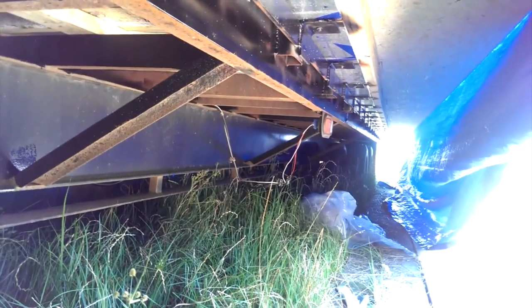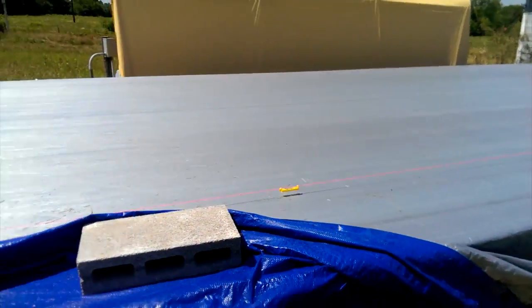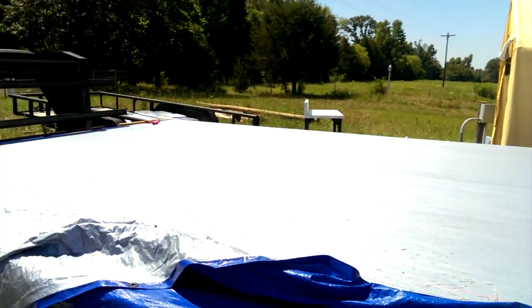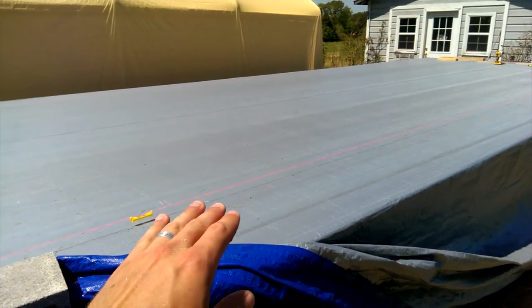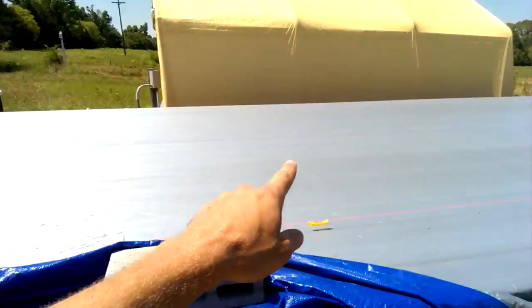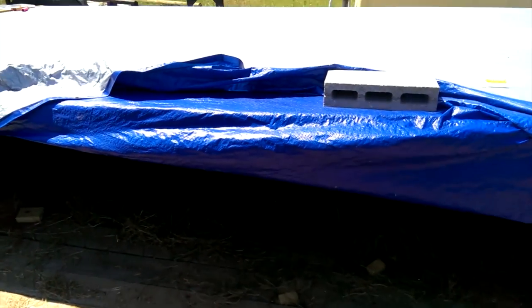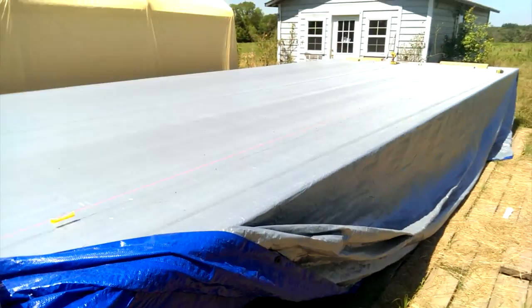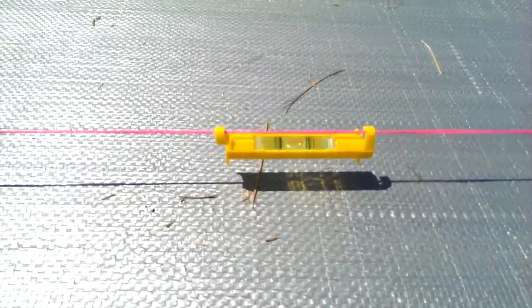You can't span this kind of distance without slight bending. What I found was: I leveled both corners and got it pretty much level, but right in the middle the floor was down just a tiny bit — the I-beam had dropped maybe a quarter of an inch from the height on either side. It's a 12-inch I-beam, but I'm also building a house on top of this thing, so it's a good idea to block up and support the mid-span. Once the house is set at its final location, we'll block it up there as well.